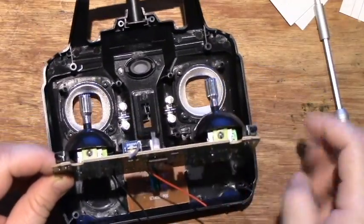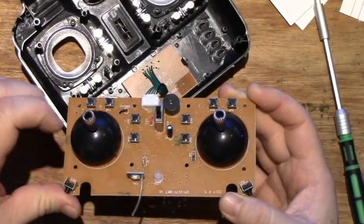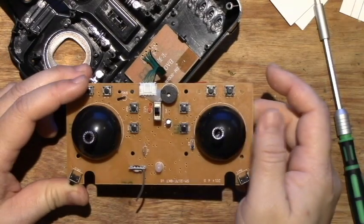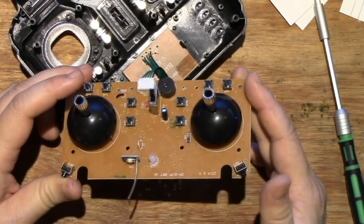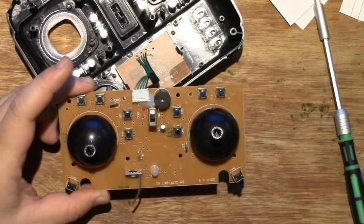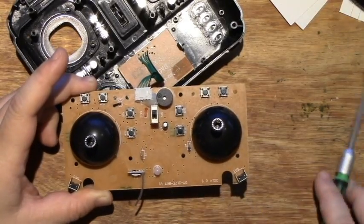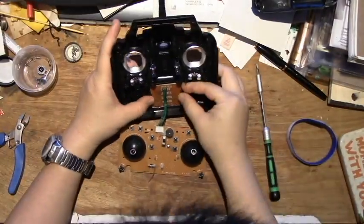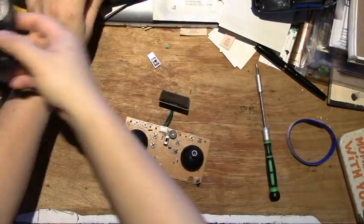You don't have to take the LCD away from the casing like I did. I wasn't thinking clearly and decided to take the LCD off. You can just unplug the LCD connector from the PCB and work with the rest of the PCB. There are a bunch of buttons — make sure you know how to reassemble all of them. There should be four sliders, two buttons on the corners, and the power button in the middle. Just disconnect the LCD from the board, but make sure all the buttons are kept and you know where they go.